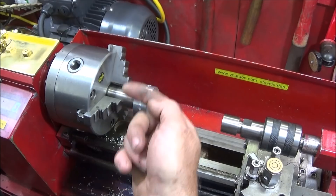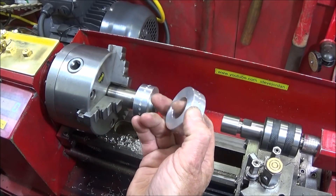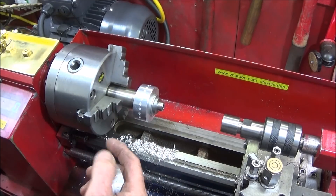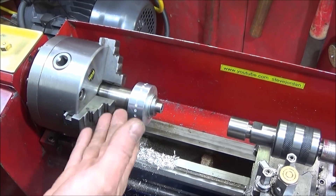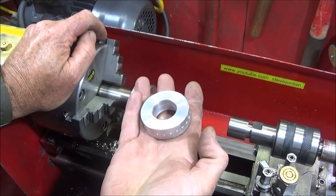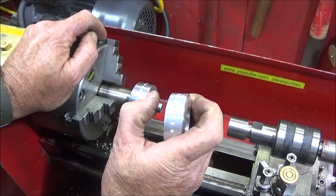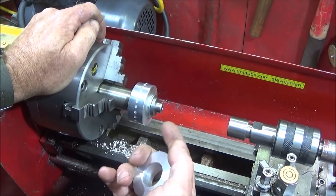It's great for singular items — if you know you're making one of these with an inch diameter bore, you can put it onto this mandrel and finish it off. It's also a great fixture and mandrel for batch work. Say you had ten components all turned to the correct diameter, the same width, and the same inch diameter bore — or whatever size bore suits the mandrel.